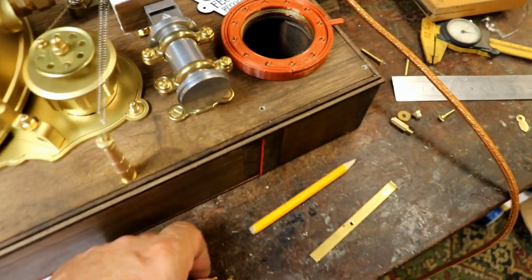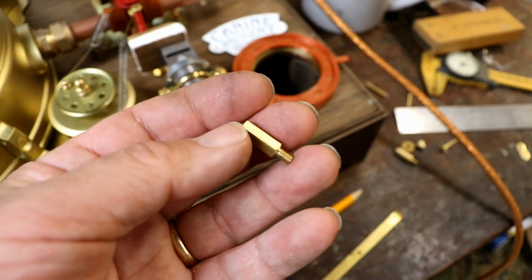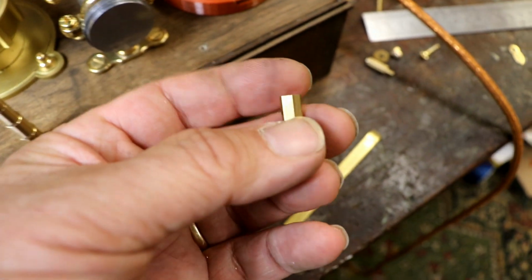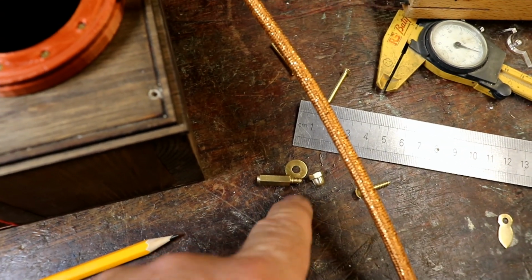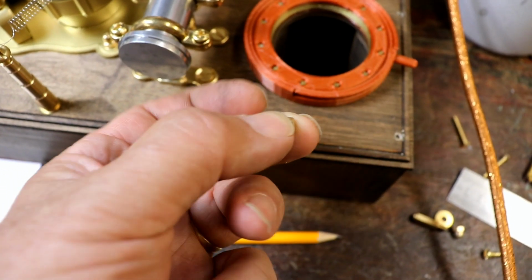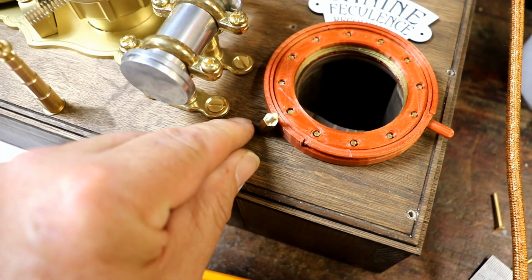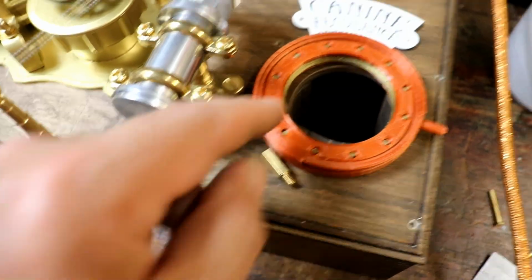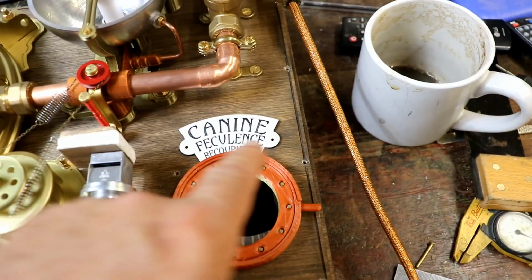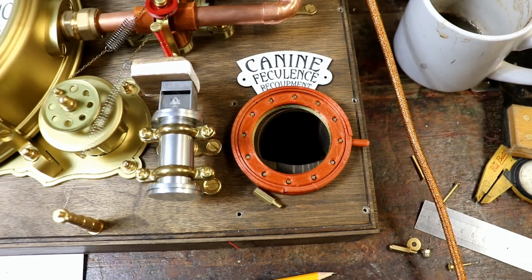Plan C. I've just found, while rooting about for something else, 3 of these hexagonal M4 threaded things that I tried to do something with that obviously went wrong, because I've got 3 of them that aren't finished, which is brilliant. Because what I'm going to do is put an M4 dome nut and a large disc washer on the top of each one, tap the bottom to M4 or whatever, and then have 3 of them that sit right up, hold it in place with their hexagonal sides, and then have them cut down to the right height, 12mm, so that the washer just sits on top. Perfect, and that will look lovely and not interfere with anything else, and I can just put these screws back anywhere as they were. Phew! Well, hopefully, phew.